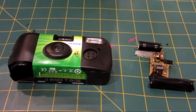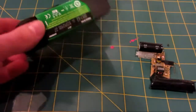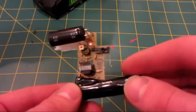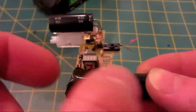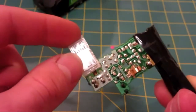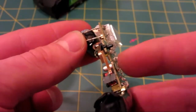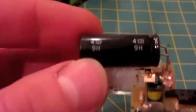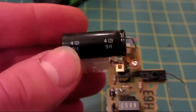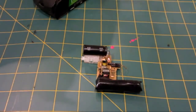You let me know what you guys want to see. Anyway, what you do is, as long as the camera has a flash, you take it apart, and really the only thing inside is this sole circuit board. Essentially what it consists of is a big capacitor, a battery, and the flash light bulb. This is the button which you usually would push on the front of the camera, and when you do so, the capacitor is charged with the battery. I've read before that some of them say like 300 volts, so they're pretty powerful capacitors, and that's what we're going to use today to make our coil gun.